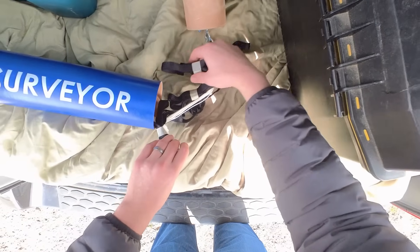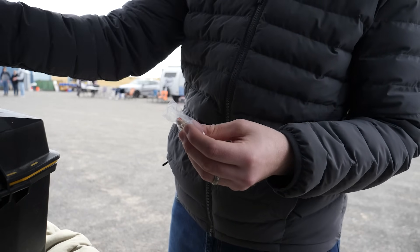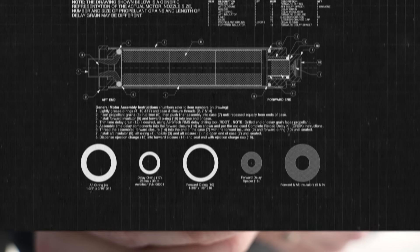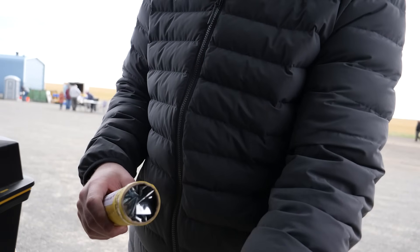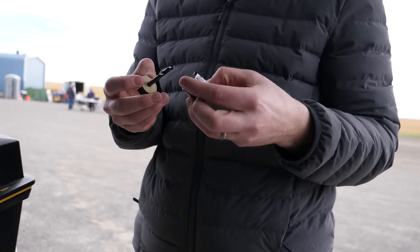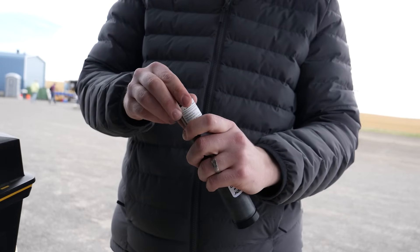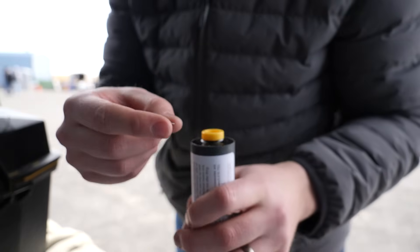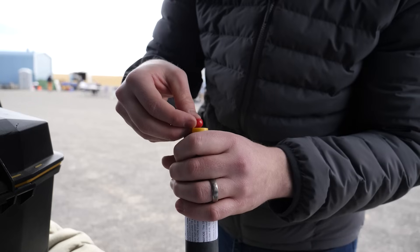With limited time in the waiver I had to get ready to fly. I checked my parachute packing and realized it was a tangled mess, so I spent several minutes fighting with the wind to get it straightened out and repacked. Then it was time to prep the motor. It comes with a capsule of black powder for an ejection charge — this is what actually pushes the parachute out of the rocket. That ejection charge is lit by a delay grain at the front of the motor: a small plug of propellant which burns at a known speed so it lights the charge at the right time. Out of the box the delay is 14 seconds, which is way too much. My simulation showed it should be about 7.5 seconds, so I used a delay drilling tool which physically removes some of the grain to shorten its burn time. I subtracted 6, giving me a nominal delay of 8 seconds — as close as I could get to 7.5. Once you clean out the shavings, you add a washer, pour in the ejection charge — I used the whole thing because this is such a large diameter rocket — and finally cover it with a cap.